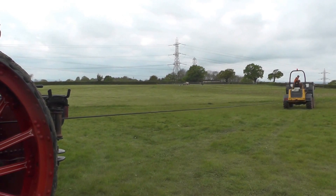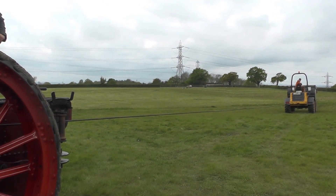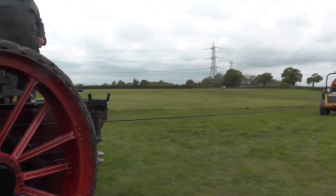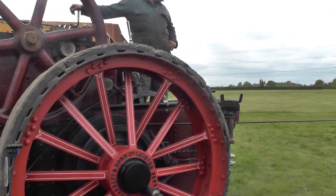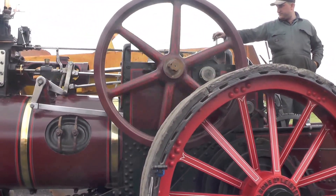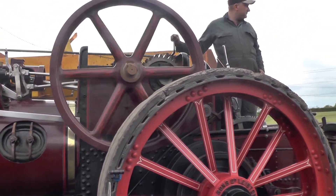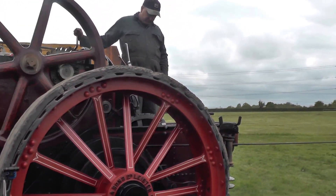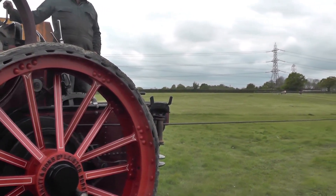The other thing — if you're doing a big winching job, don't forget your axle is now rotating in that back wheel bush. So if you're going to do a lot of work, fetching trees out, you need to lubricate that back wheel, because your axle is turning in that wheel, whereas normally it wouldn't. So that's another thing you've just got to remember — if you're going to spend an hour winching, you want some lubrication in there.